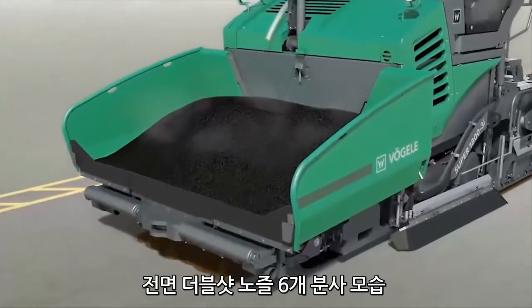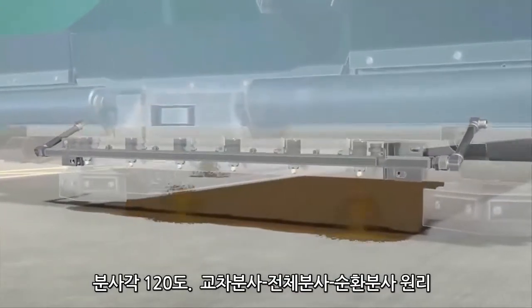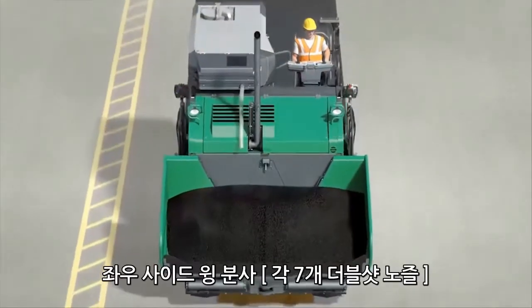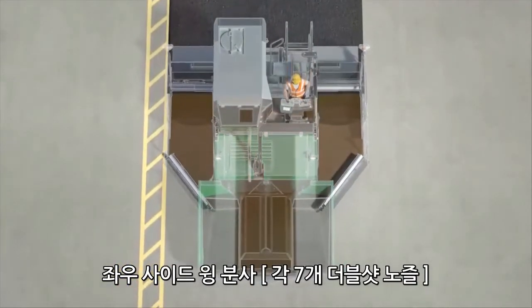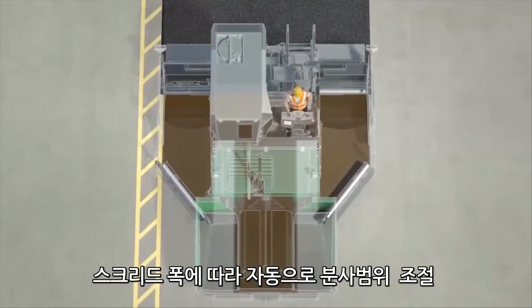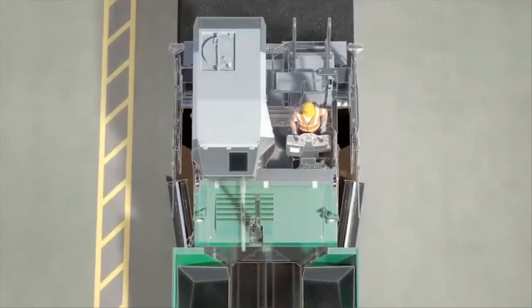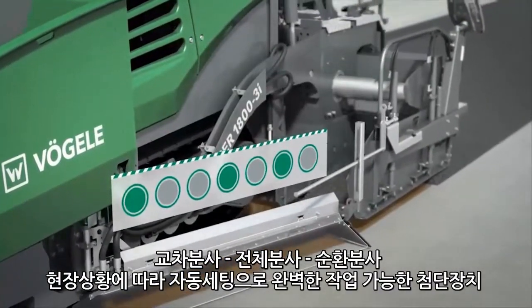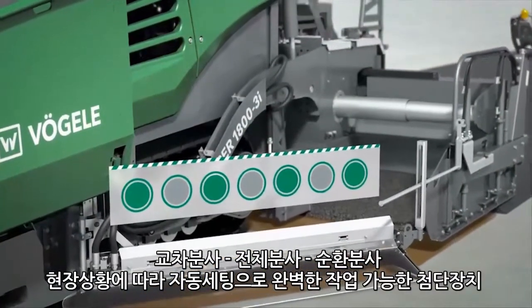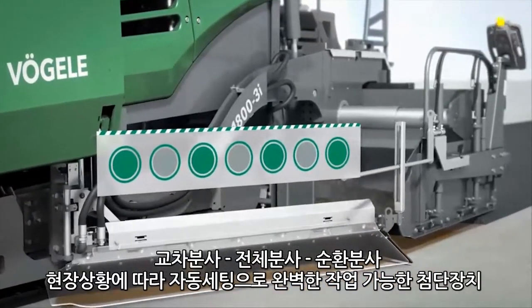The front spray bar is located directly behind the push rollers between the two crawler tracks. Two movable spray bars are mounted on the right and left of the paver, which, being connected to the screed, can move to adapt to changing pave widths. When the pave width increases, closed spray nozzles are switched on. When it decreases, they are switched off automatically.